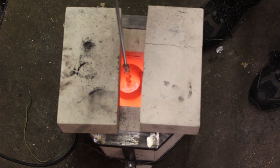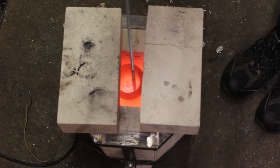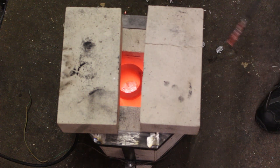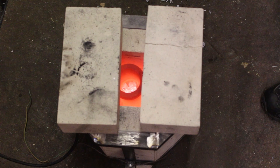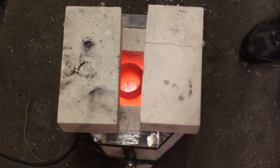Do this gently so as not to add any more bubbles to the metal, and slowly scrape it off until it's shiny. This isn't completely necessary but is another step to further purify the aluminium and get better results in the roundstock.